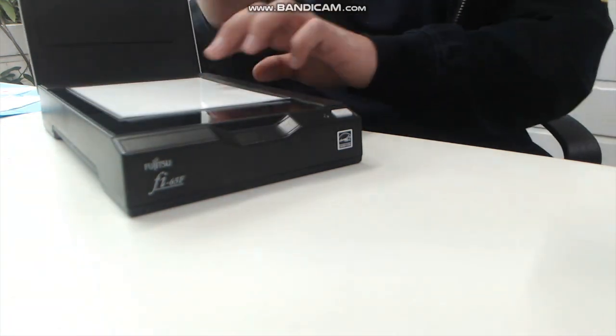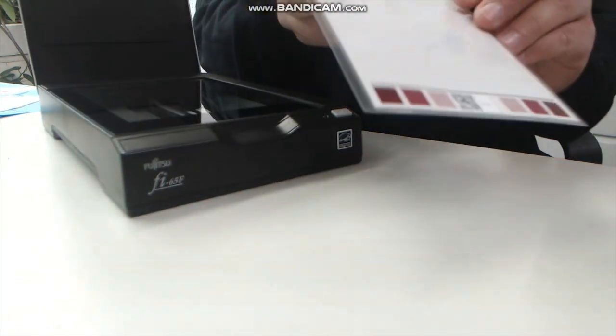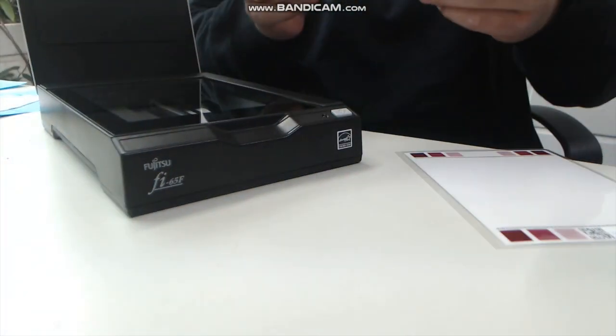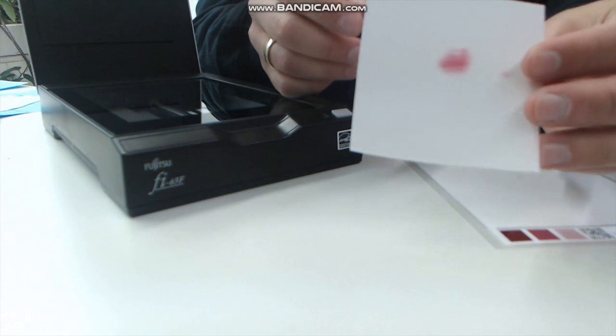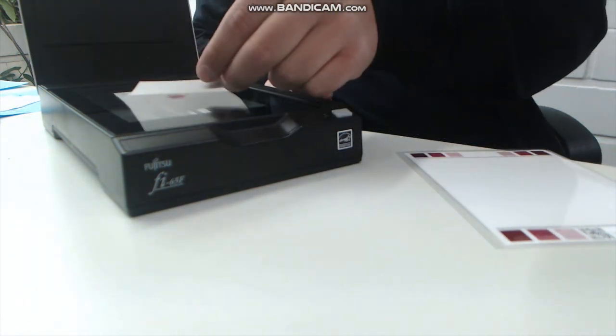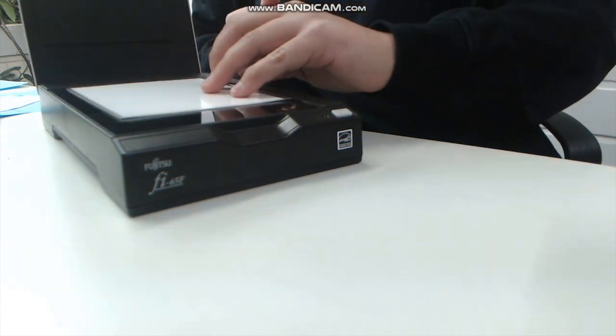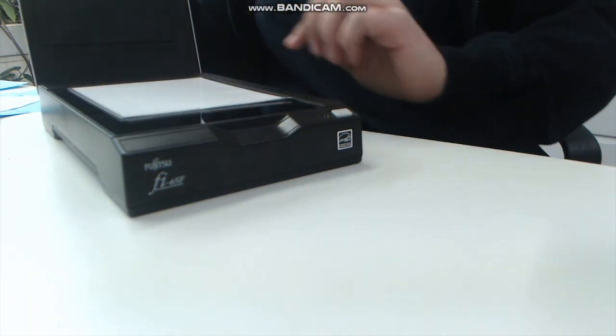To import the pressure data, click scan and select the appropriate scanner. For the scan, a calibration sheet is necessary. Put the measurement film on the scanner rough side down. The calibration element is placed over the Fujifilm. Now perform the scan.